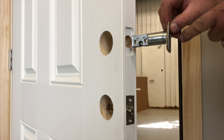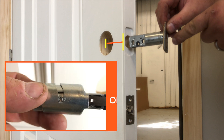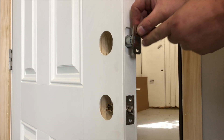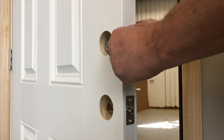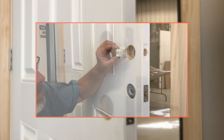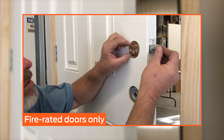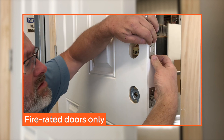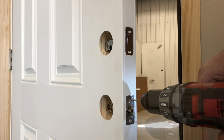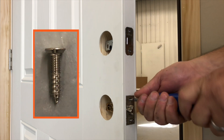If your door is a fire door, first insert the UL cup into the bottom face bore from the inside, then insert the latch bolt as shown. Before installing the deadbolt latch, set it according to the measurement between the vertical center line and the door edge — either 2⅜ inches or 2¾ inches. Then install the deadbolt latch into the top face bore, ensuring the latch is oriented so the word 'top' appears on top. If your door is a fire door, insert the deadbolt UL cup from the inside first, then insert the deadbolt as shown. If your door is not a fire door, neither cup needs to be installed. Drill pilot holes in each of the screw locations, then secure each latch with two combination thread screws.